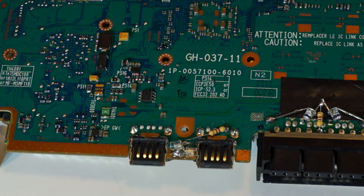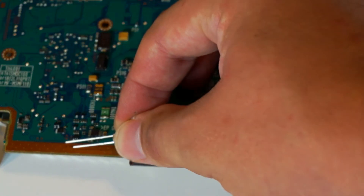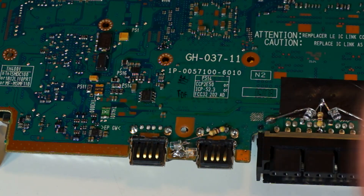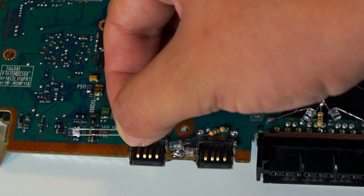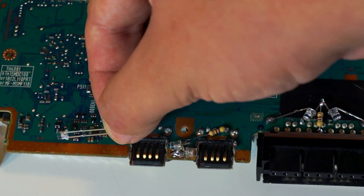Now you're probably wondering about these two LEDs here. What I did was cut my legs really short, then soldered the negative legs directly to the grounding — I did this two times, one facing each direction. Then I took my resistor and soldered my positives to that, connecting the other end to my 5V source.